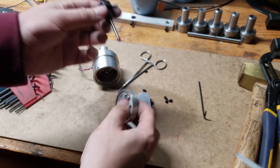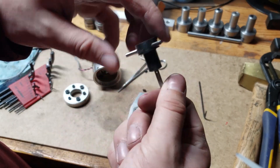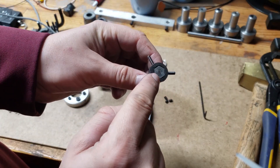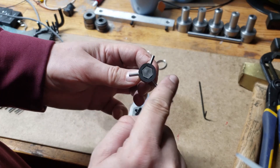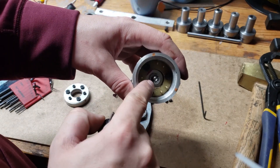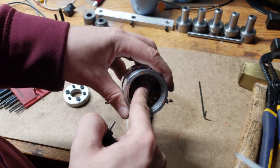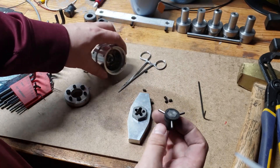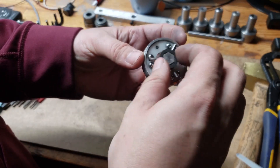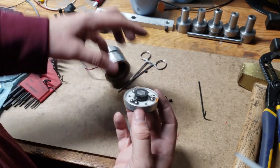This was constructed — you can buy this; I got the actual probe tip from Renishaw — which is threaded into an arbor that I made from Delrin, screwed in with a quarter-twenty bolt on the lathe, chopped off for a flat indexing point. The body has another ball with a piston — a spring-loaded cylinder — that pushes down on this, which pushes down on the balls to keep contact, ultimately adding resistance to the probe.